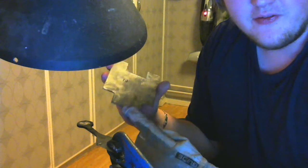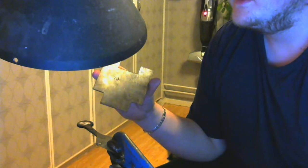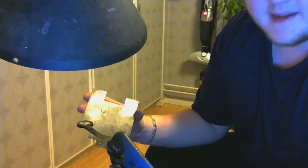Now this is actually a gauge, believe it or not. This is not really a precision-made tool, but it is a tool you use to gauge whenever the hitch loop and the hitch hook of a tractor needs to be replaced. Basically, when this end fits inside of the hitch hook hole of a tractor, then it should be replaced. And when you can fit this around the hitch hook of a tractor, it should be replaced. Then the gap is simply too large, or it's simply too thin. That's just a rule of thumb kind of thing. Something established years ago. I'm just gonna go cool this off rather quickly.